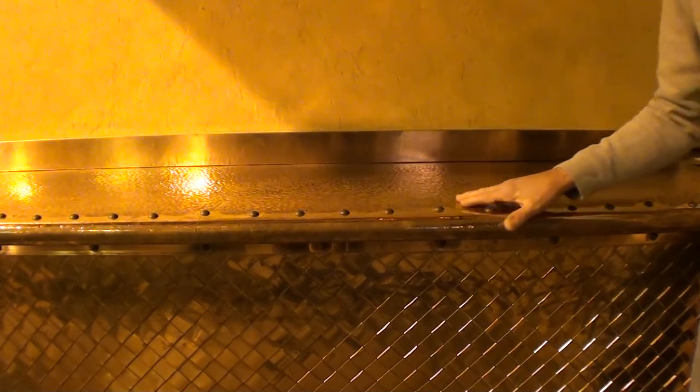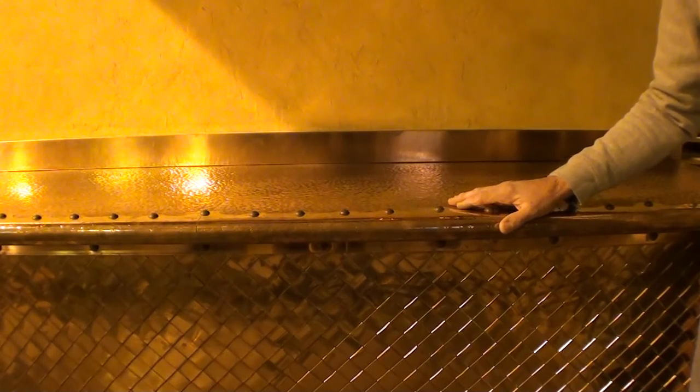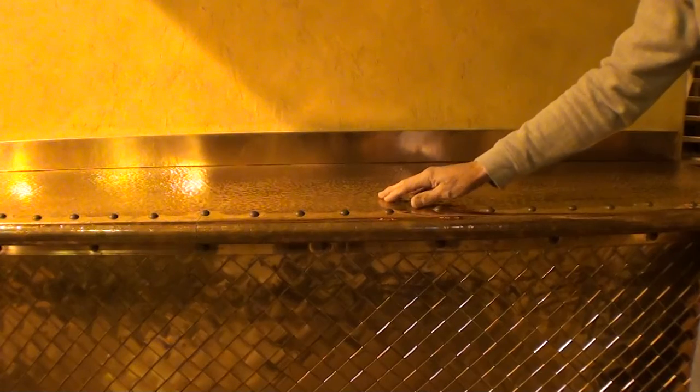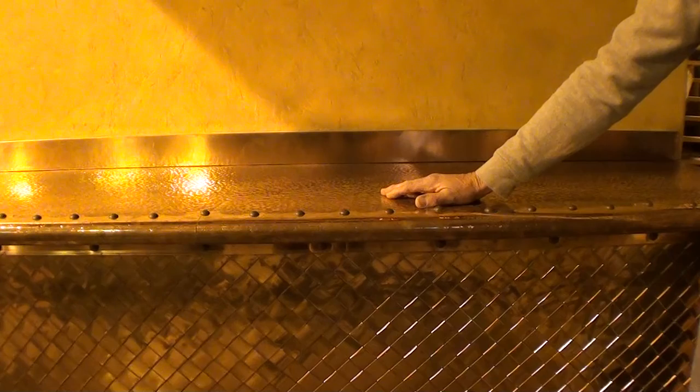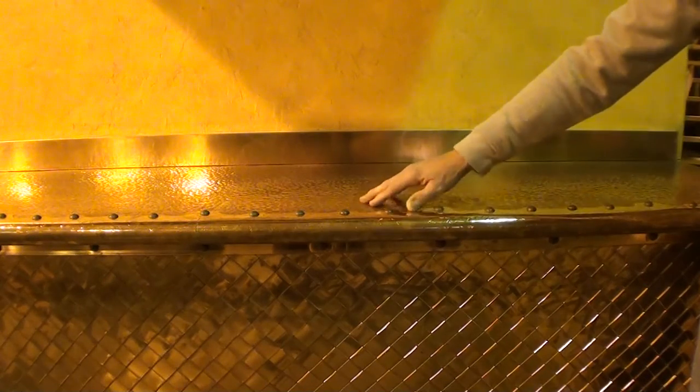The wood substrate is perforated — we drill a bunch of holes in it because the glue dries through evaporation. Depending on the temperature and humidity, it can take two or three days or two or three weeks to dry, then we actually do the hammering process. The glue has got to be dried thoroughly, otherwise whenever you start hammering the top it will delaminate.